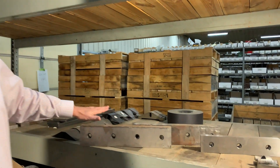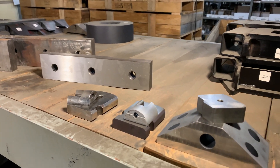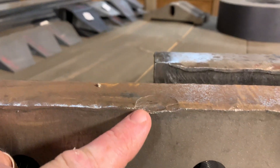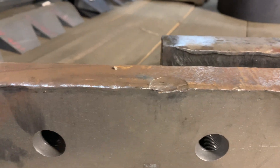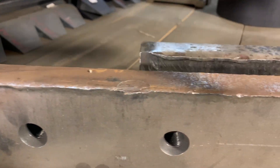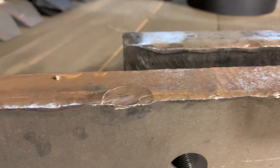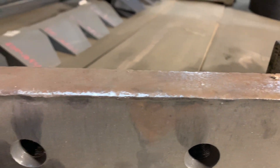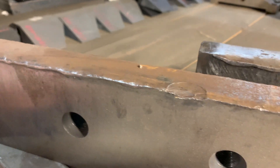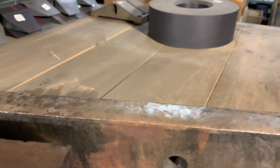We brought some examples here of some well-worn blades and some brand new blades. When we're talking about a shear like our H3000 or maybe H4100 guillotine shear, you'll start to see some pretty obvious problems with the blade. Here you'll notice about a quarter moon cut out — this edge is really dull and it's starting to actually push the steel over a little bit. If I wanted to cut myself on this it would be very difficult because it's just not sharp. In the scrap bin next to this particular shear blade I would most likely see bent pieces of bar where the very end was bent and also kind of pushed over or peened. Whenever you see that mushing or peening on the end of the rebar, it's a good indication that this blade is probably beginning to get dull.